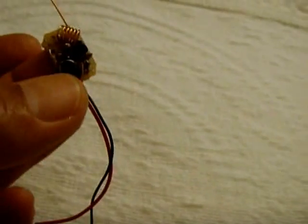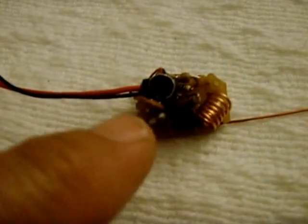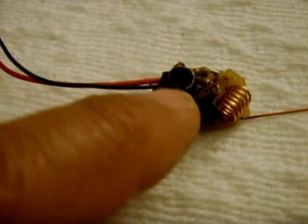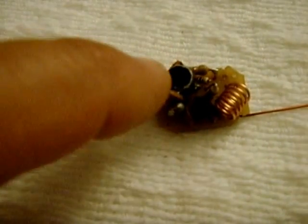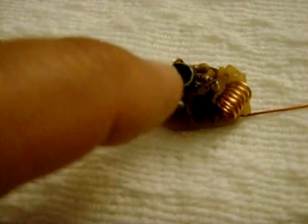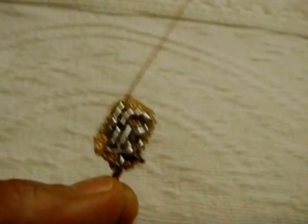It's very tiny and for its size the sound quality is very, very good and the range is excellent. It's really easy to make and it works perfectly. You might want to experiment with the value of the resistor going to the mic from the positive rail, because that'll adjust the gain of the mic since you're not using an amplifier. For me, a 12k resistor worked perfect for the microphone I got out of an old cell phone. I'll put the link in the description box — give it a shot.